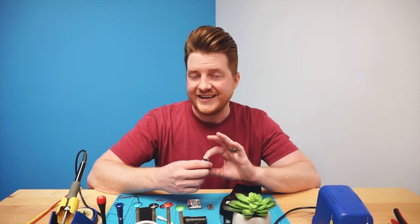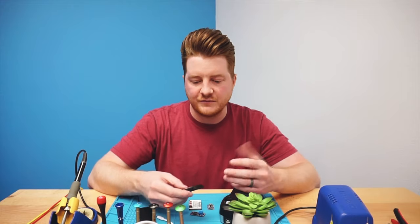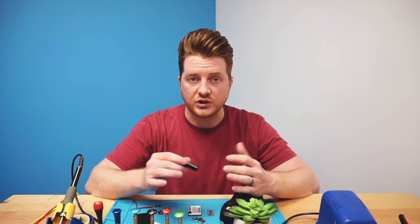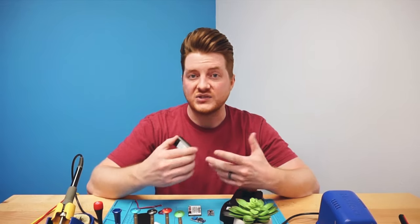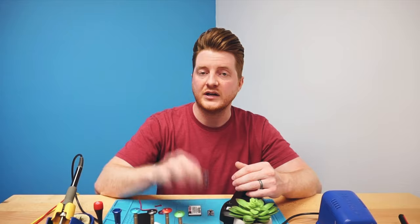You'll also need a voltage booster. A lot of devices use different power than the actual cell phone battery — for instance, my multimeter uses 9 volts, and this Dymo battery is 7.4 volts — so the booster cranks up the voltage to the appropriate level for your device. A good thing to keep in mind is to put it about half a volt over the original battery voltage, right at about 7.8 volts in this case. That puts you in the sweet spot of a partially charged battery as far as the device is concerned.